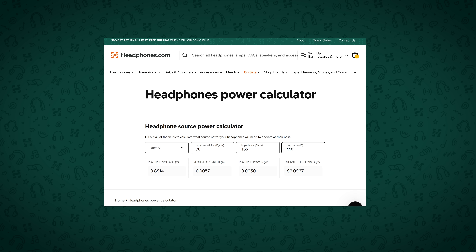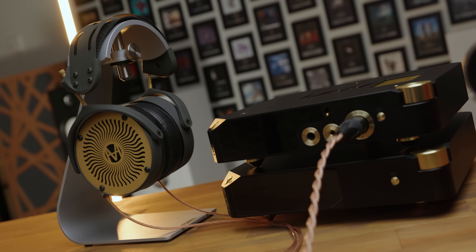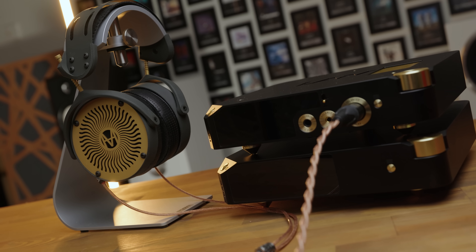So if you listen at 85 dB, you can't just work out what you need for 85 dB on a headphone because you have to factor in crest factor. If we add an extra 20 to 25 dB into the calculator, the result lines up much more closely with what I just measured. If you put even a small bass shelf on this headphone, listen to a song where the bass is a little bit louder relative to higher frequencies than this one was, or just listen a little bit louder than I do, then even a 20-volt amplifier — which is basically all other headphone amplifiers on the market just due to how the power rails are set up — will not be able to avoid clipping. Regardless of whether they can do 10 watts at 32 ohms and have plenty of current to deliver, they're limited to 20 volts output. And remember that decibels are logarithmic — 6 dB extra doubles your voltage requirement.